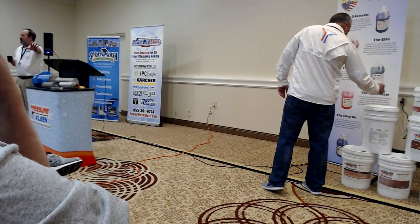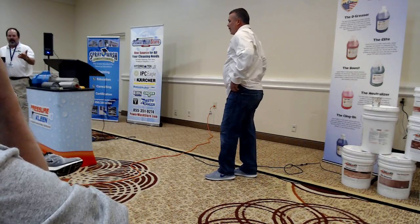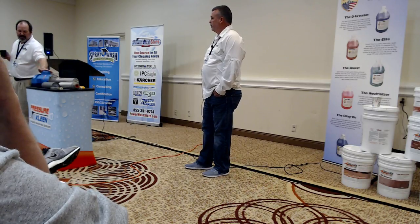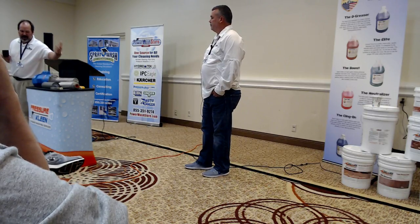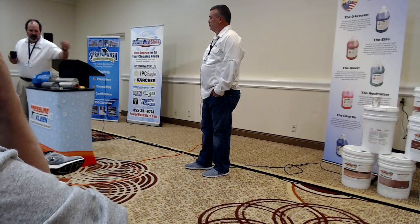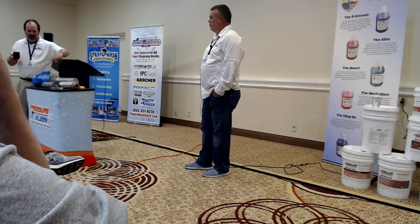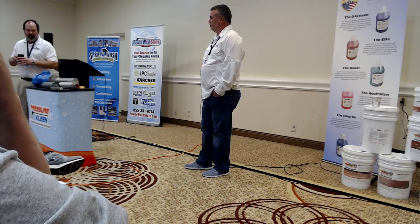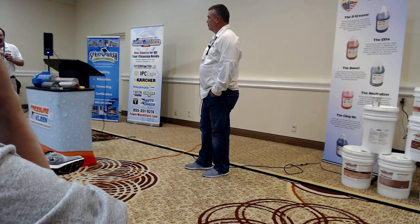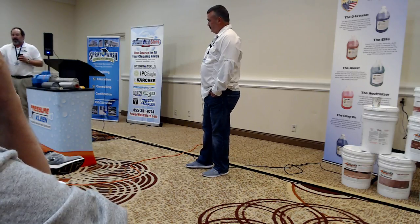But now these things are great. It's not just water and bleach. On my parking garages, I'll go in there and put a caustic degreaser down, or my EBC, with a pickup tube on my proportioner, either put it in a soap tank or a three-way on the soap tube. And so now it's freed up my pressure washer for the guys to go ahead and start cutting in the corners, because we're not downstreaming the stuff out of this.